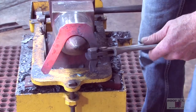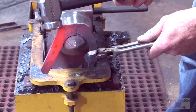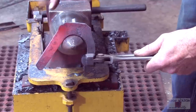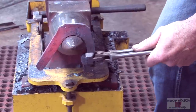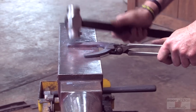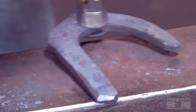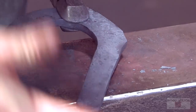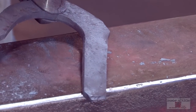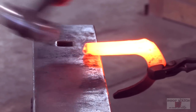Once you establish where your commitment mark is, you don't ever go revisit that. It'll form itself just by pulling this up. It'll pucker and make that deep. You don't ever have to revisit hitting that. It doesn't hurt to put a little bit of this boxing in because this will make your outside heel a little bit sharper. You can see I'm creating a nice sharp line there, but it also crispens up all those aspects of it. So I have material to forge now. Just one time revisiting the heel.